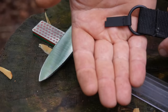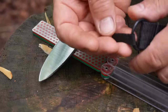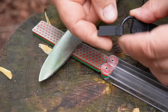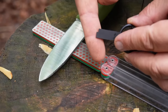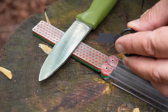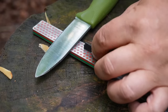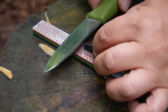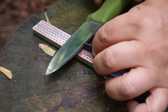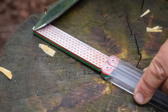In order to be able to control these six millimeters, I made a little step in this small band on the rubber ring — can you see this step? From here to here is six millimeters. So I can take this band, put it on the surface of the diamond grinder, and now I know I have six millimeters — so this is the angle I have to sharpen with.